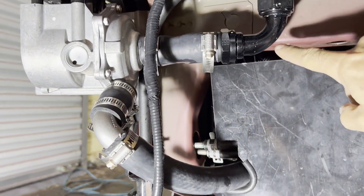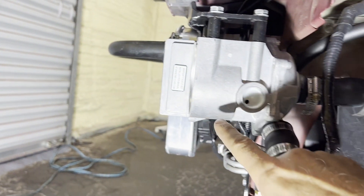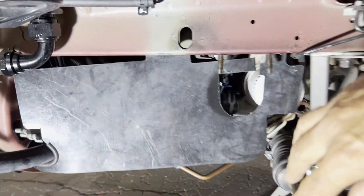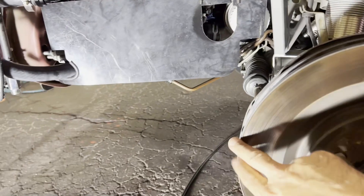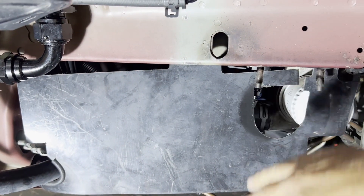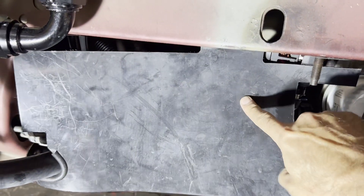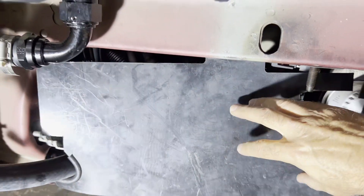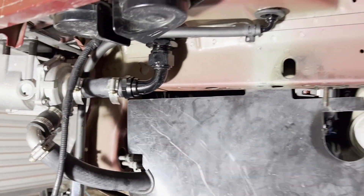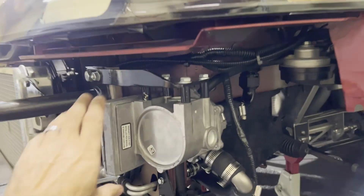Here's the EMP pump. From where it comes out of the reservoir all the way to the tip of the furthest end, we have about 13 inches. If we flip it around it's gonna come way in here — the rotor would be way over here, and that's just too much interference with the wheel. Even if we try to tuck it back under here we've got the alternator right behind, so I'm not entirely sure what's gonna be a good plan.